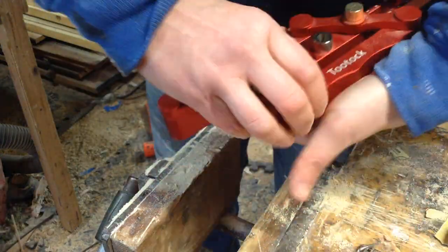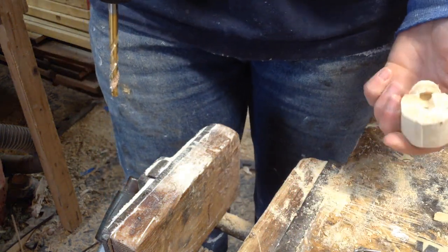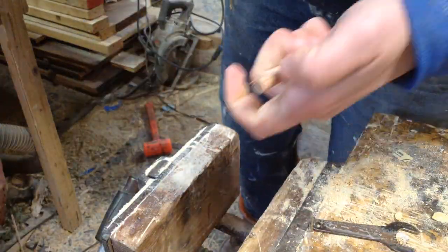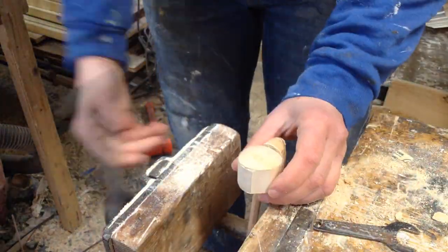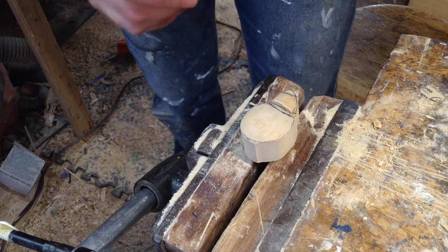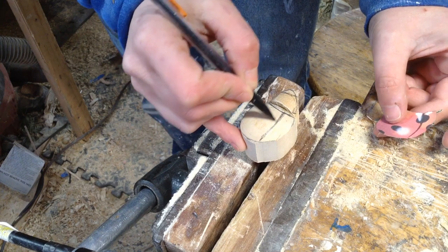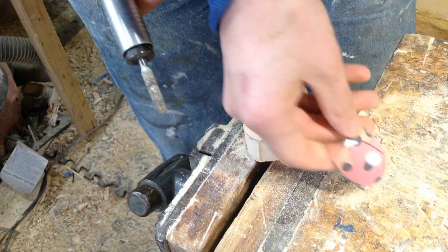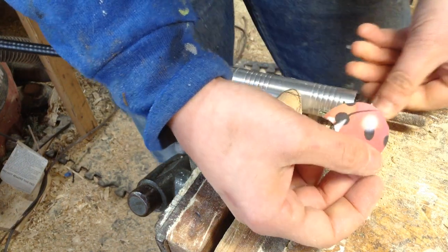In order to attach this to the piece I'm once again using a dowel - I just drilled a dowel hole in the center. I believe these are 5/16 inch dowels. I left the dowel long so that I could use this in my vise, just glued that in place. Someone in the comments of my last video made a good point that they use a square block of wood in the vise so they could turn it much quicker than the rectangular piece I use - that's a really great tip, so I'm mentioning it. Going forward I'll do that instead of the rectangle; it just saves the time of having to open and close the vise that much.